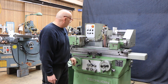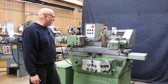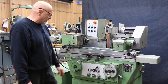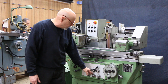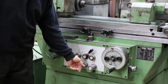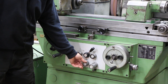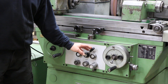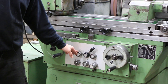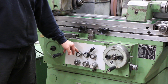The first notch we turn on our headstock here, the second we'll bring the slide forward, and the third we'll start the machine to move. Down here you've got a bunch of control knobs — the center one controls the speed of the table and this will go as slow as you can possibly make it. This is the main control lever; this controls your dwell; this controls whether you feed or increment on both sides of the workpiece, or just the left side or the right side.